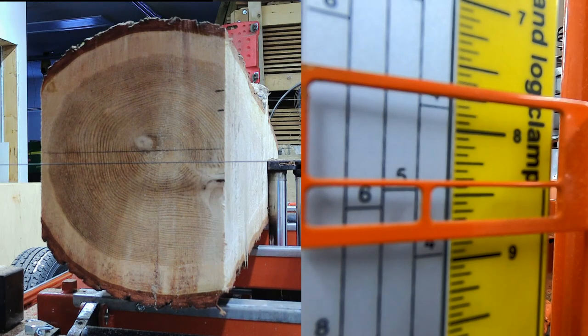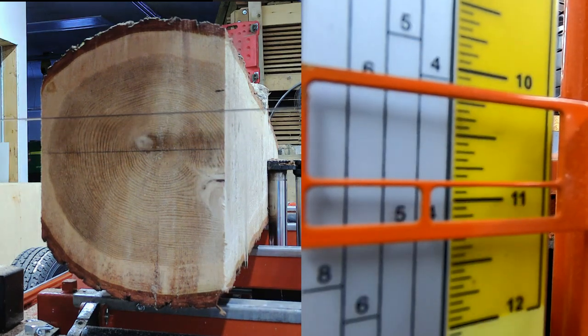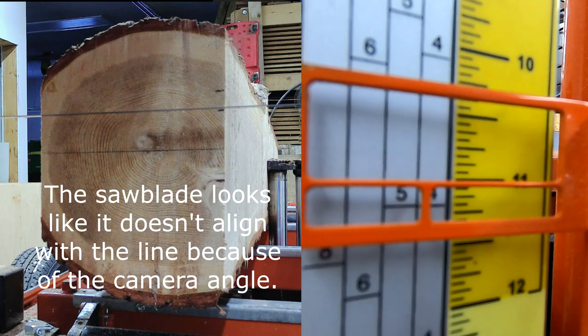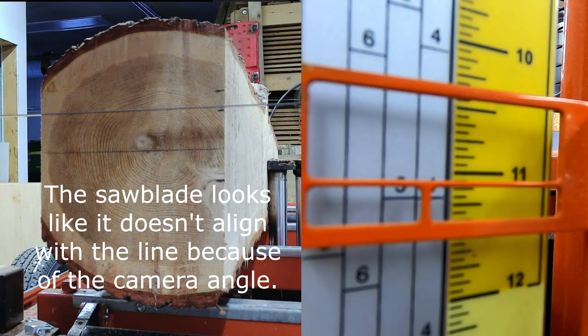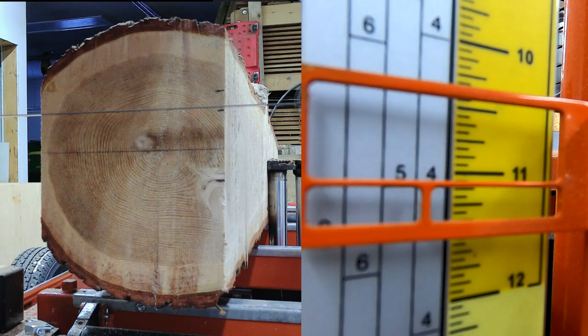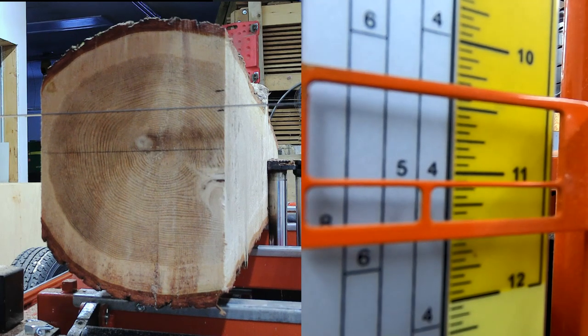We're going to raise it up here, but instead of stopping at the center, I'm going to stop at the 4-inch cant mark right there, and I'm going to do the exact same thing. Let's cut 4/4 now. So I'm going to loosen the scale right here, and we're almost at a 4/4 mark. So we'll raise that up a little bit. Now we're at 4/4.